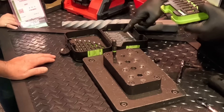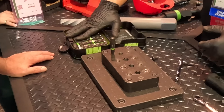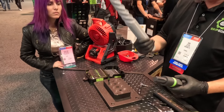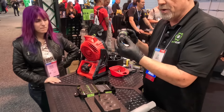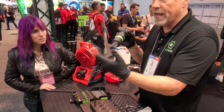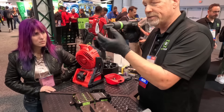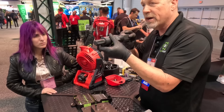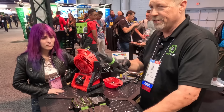Underneath is a left-handed set of drill bits. The index tells you which one to use with which one. We have an example here of a tapered cone extractor versus ours — ours is a straight cut, not a tapered cone, which means when I drill a cavity and hammer it in, I've got 100% engagement — not just at the top leading edge with a cone. I have these little flutes that cut grooves into the cavity that lock it in, so now I'm bi-directional and can work things back and forth.